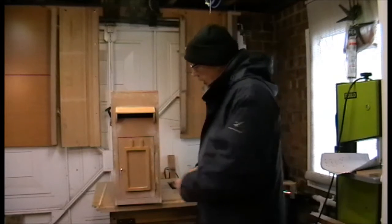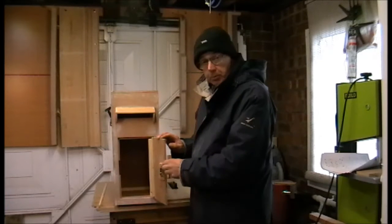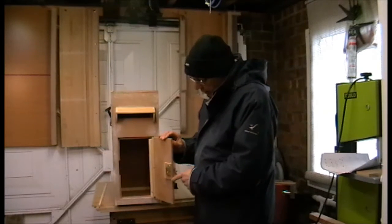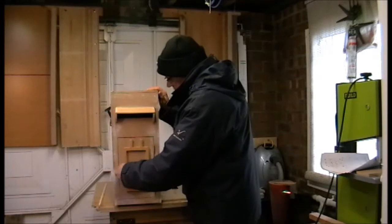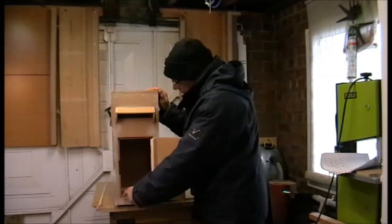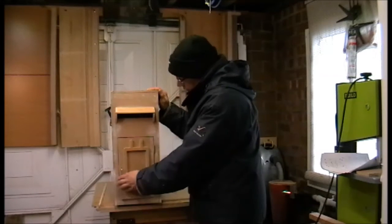Unfortunately the battery died when I was doing the lock, so I can't show you actually fitting that, but you should be able to see it's now fitted. I put it on a spacer of MDF, simply because the screws I've used were 3mm by 20mm, so they've come through the outside, and I've put a spacer on to account for the screws. I've also put a little nick on the frame on the inside so that the deadlock fits in there to lock it. I've also used some strap MDF on the face at the bottom, top and down the sides, so that when you shut it, it doesn't go inside — it keeps it level. So that bit's now done.